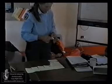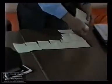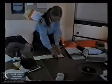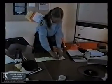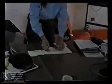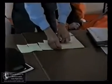For each alternate row in the corner, you want the smaller sandbags. And it all gets bashed in with a pick handle or, Dennis here said, a shovel handle, to make them all pack in. And it'll all settle down and make it watertight.